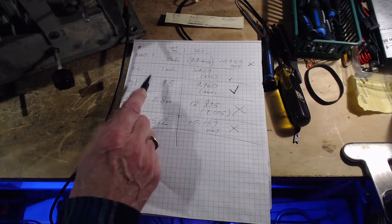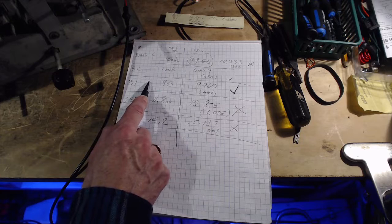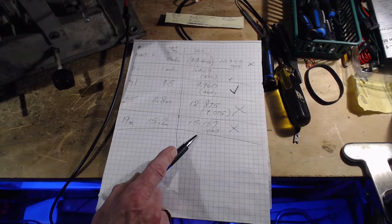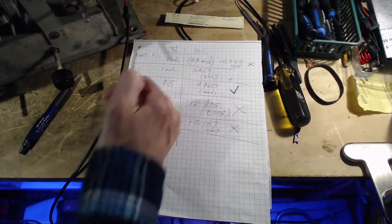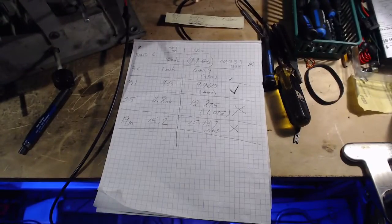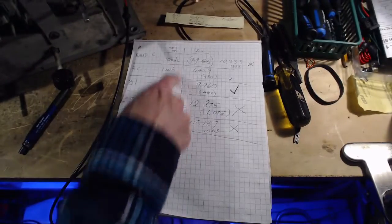That's my thinking. So if I'm correct, if I make doubly sure, it's 460 by the way. 460 is the IF frequency. If I make doubly sure this is correct, and then follow the steps very carefully, I should be able to bring all the rest back into the proper zone. That's what I'm thinking. It's not like aligning one band has no effect on the others. It seems to be this one here is absolutely critical. Okay, I think I know what I'm doing. My camera got excited there. You know what's happening? It's stumbling on the pattern here, the cross pattern.